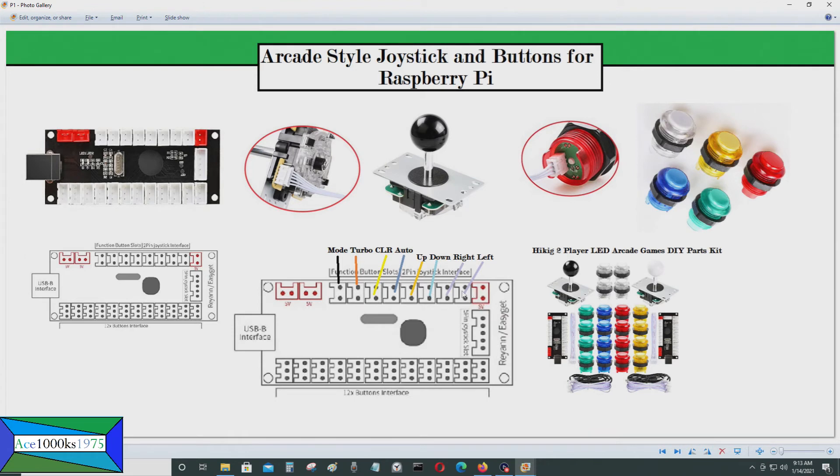If you want to get more detailed, you can use this part right here. This is for the joystick — same as on the bottom section except you have to plug it in individually, and you'd need to use a five volt power supply. On the bottom part you don't need that — it's simpler. For buttons just plug in here, for the joystick just plug in here. The board comes with two boards to connect two joysticks.